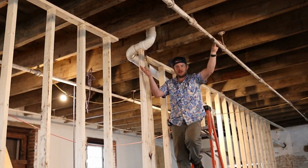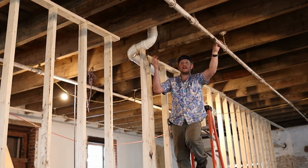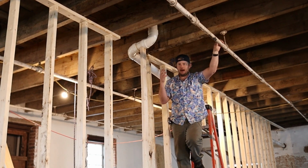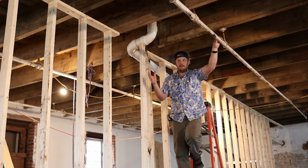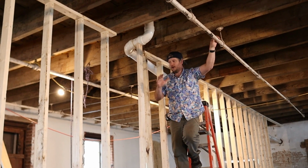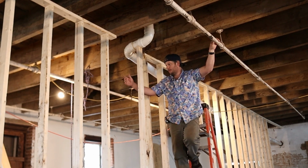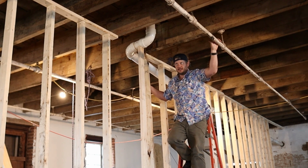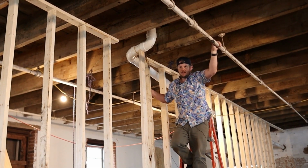So yeah, you saw the craziness. That was nuts. We were able to get it back up. The root of the problem is any plumber that goes to Lowe's and buys a pipe boot, uses that pipe boot on anything, in my opinion, should be barred from doing plumbing the rest of their life. You cannot use rubber pipe boots almost in any circumstance, unless you are just trying to get through an emergency, but it's a temporary thing. So anyway, a pipe boot fell out because that's stupid.